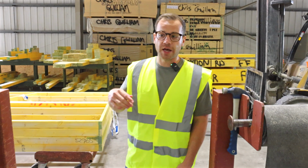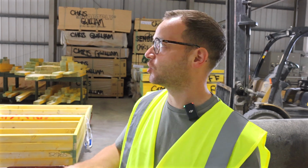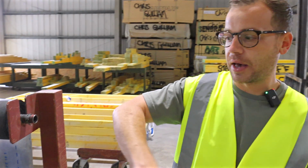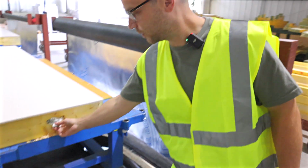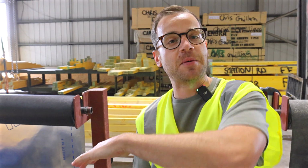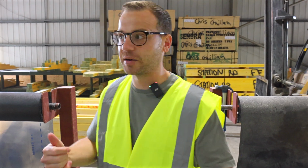Now these boards, these closed panels and open panels, they're very heavy. And when they're trying to lift them up, obviously that would be backbreaking to do with just human power. So essentially they've got this hoist or crane, and they tie these little ropes here. Look, I don't know if you can see that, but they put these ropes onto them, which allows them to hoist that up into the air and flip the panels over. So once they've done the vapor barrier, they then can do a breathable membrane on the other side or fit the insulation. So it's a proper system and a process. It's incredible.